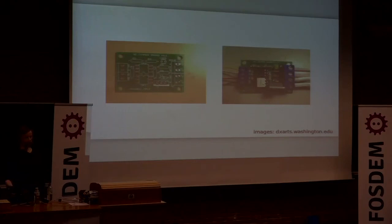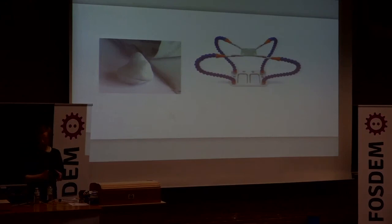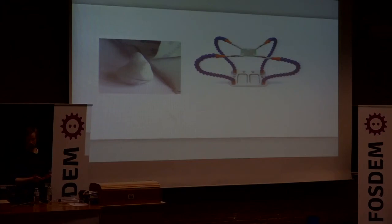Now let's say our PCB has arrived and we want to go from the bare PCB to the assembled board. The first step is to make sure your PCB stays in place. You can use BluTAC for most jobs — the only problem is that when you heat up the board it tends to melt away. You might opt for something better like a third-hand or Kraken tool, and there are even more professional tools if you're willing to spend more money.